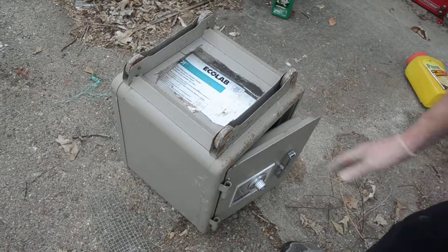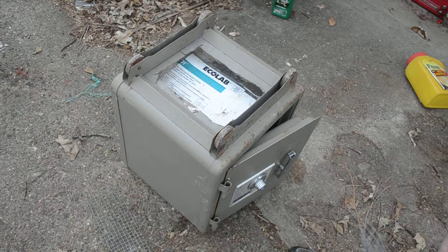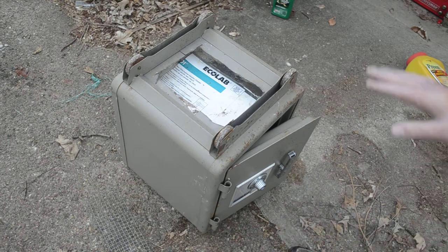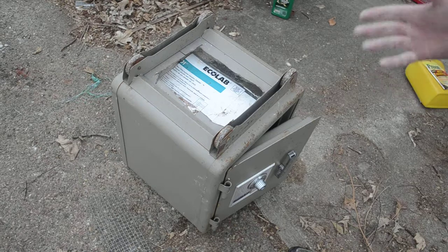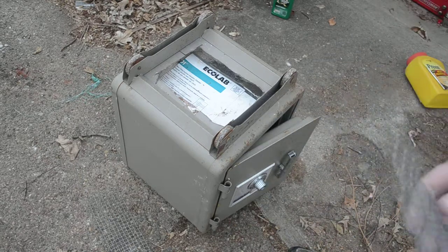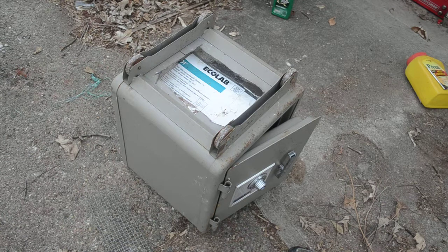Second, what I've done is I've put a piece of metal in. I just salvaged an old sign and put the metal in. Under the metal I put a line of regular window and siding caulk, to prevent the concrete slurry mix from dripping in.